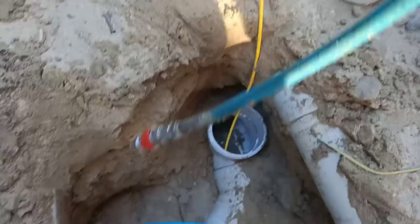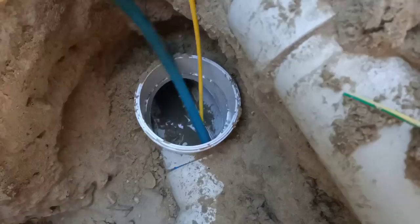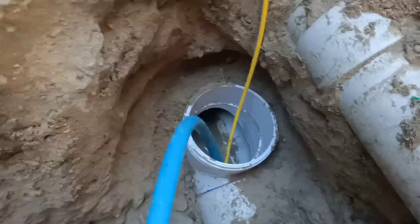I'm going to send the jet upstream - we'll try and jet this towel or rag, whatever it is, send her backwards and try and pull her out. I just have to make sure we don't jet it too far past this inspection opening. I just want to get the jet just in front of the camera there. Alright guys, we meet again inside the drain - easy does it and we'll fire her up.